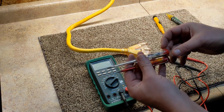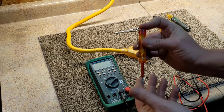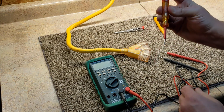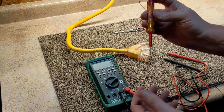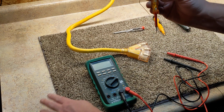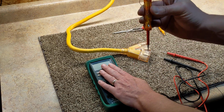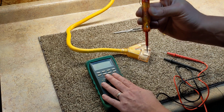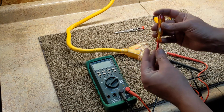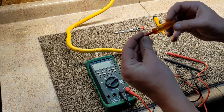These are a bit of the older style — you actually had to ground yourself out and then stick it in. You put it in and a little light comes on. If there's voltage there, they're good from 100 to 600 volts. On the lower ones you really have to make sure your other hand is on a good ground to complete that circuit. I've actually used this one on 600 volts and it'll give you a good tickle — I honestly don't recommend it. They're okay for quick tests if that's all you have around the house, but you definitely don't want to use them for bigger voltages.